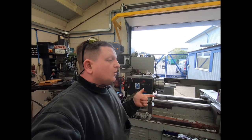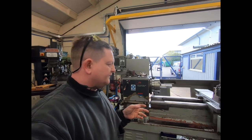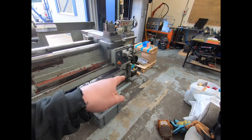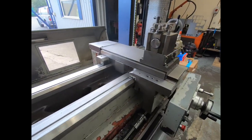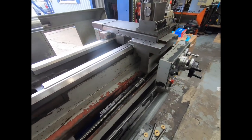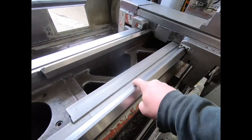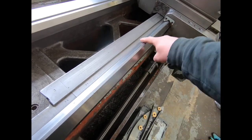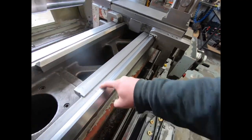New oil which will obviously get swapped out again — but that's a simple fix. The pump at the bottom wasn't working, now it is. The rear end of the saddle and the axis is getting fed with oil. This front section and front wiper plate isn't, and the ball screw isn't — and that's probably another reason why the Z axis is so worn and potentially why the bed is so bad. It's not so much wear — it's definitely worn — but it's more gouges and abuse from lack of maintenance and cleanliness that has caused this bed the most damage.